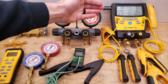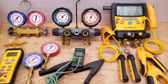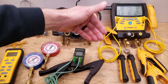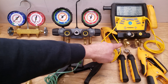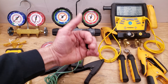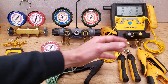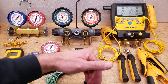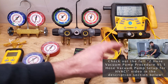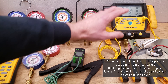We have quick reference cards — this one has a target superheat chart. If you have your indoor wet bulb and outdoor dry bulb temperature, you can determine what the target superheat needs to be on this chart. We also have our book with a larger target superheat chart covering indoor wet bulb, outdoor dry bulb, superheat, subcooling, and troubleshooting. Getting back to this tool, you can press the target superheat to get back to the main screen. You can calibrate your temp sensors with this adjustment screw, and also calibrate your atmospheric pressure to make sure you're at zero before you hook up. Once again you still have four ports here so you can pull a vacuum through this manifold — but personally I've had enough frustration over the years to know it's not worth pulling it through the manifold. This tool also has a built-in micron gauge, but only if you pull your vacuum through this manifold.